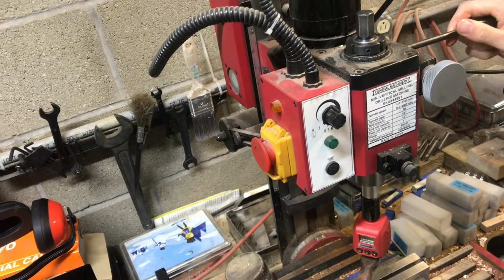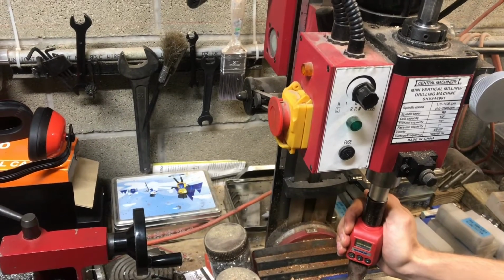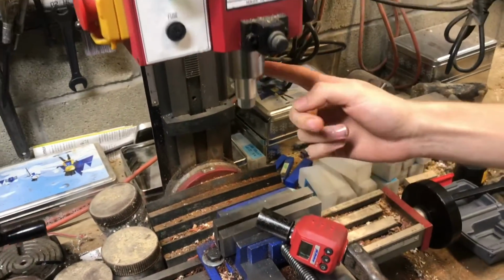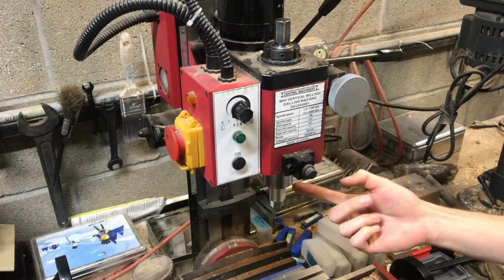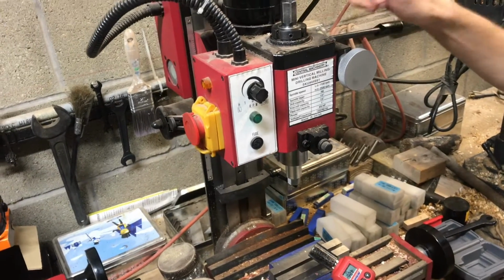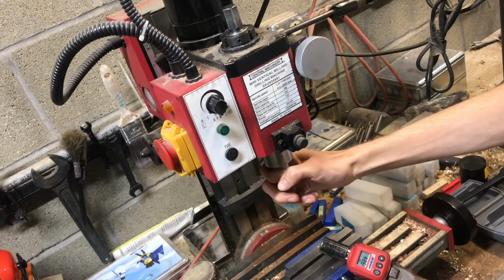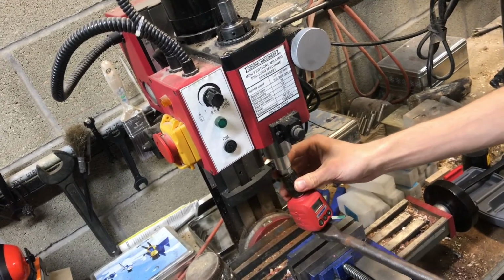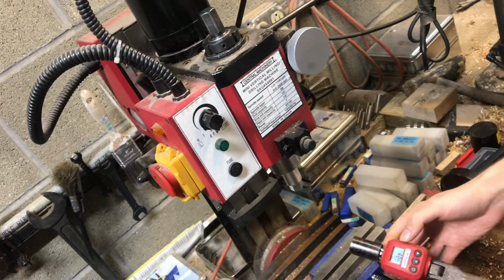So the spindle lock is in its key, and I'm going to... Okay, it's 40.6 foot-pounds. Obviously that number will increase with the drawbar tension. However, if you bought a serrated collet and you wanted to know how much improvement that is, it doesn't really matter what your drawbar tension is as long as you repeat the trial at the same tension. If it's 100 psi on your drawbar, you would want to make sure that you use the same 100 psi for both tests.